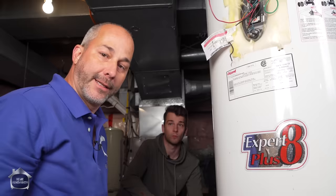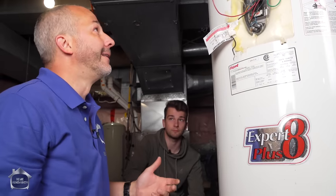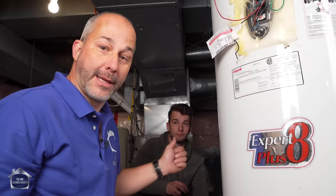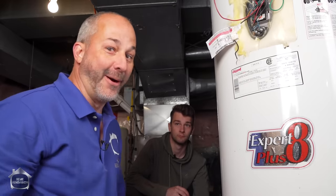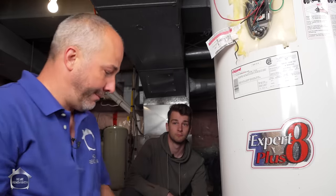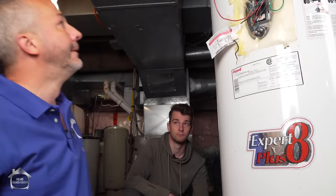The last thing you need is for, let's say, your daughter's favorite hairdryer plug to stop working, and she comes down and flips that breaker back on while you're working. So you can always tag it out or tape it or leave a sign or something. Make sure people know that you're messing around with power.